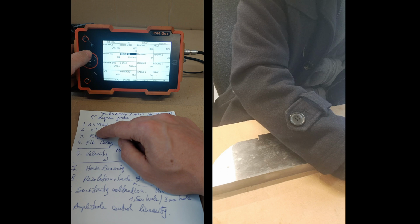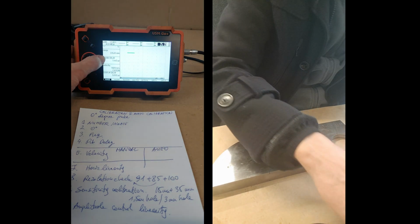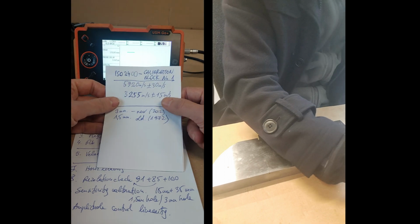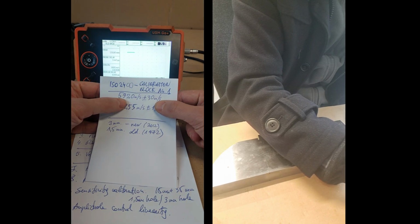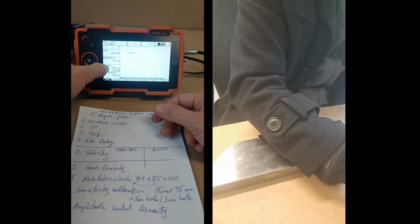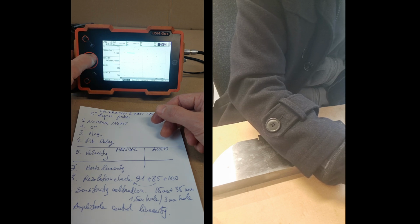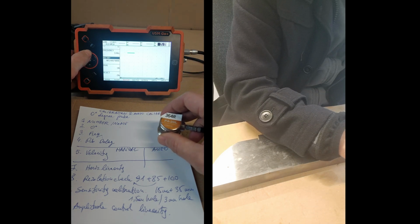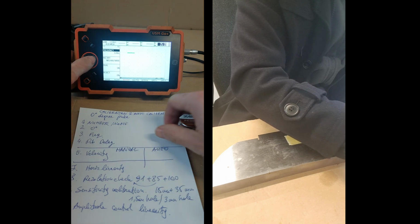Okay, we're going back. The range. Probe delay should be 0, but we can maybe leave it because we will use autocal velocity. Here, according to the standard, that's good enough. That's exactly the number I need. But then we don't use autocal, or okay. Receiver. That's 4. Frequency.